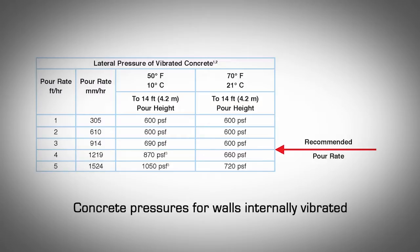Rate of Pouring Concrete. When fresh concrete is poured into AMVIC ICF, it exerts lateral pressures on the sides of the EPS panels. The intensity of this pressure depends on several factors including the rate of concrete pour, unit weight of concrete, type of cement, concrete slump, concrete temperature, height of the pour, and depth of internal vibration. AMVIC ICF blocks have an ultimate forming capacity of 864 pounds per square foot, as tested according to Section 6.4.4 of the Canadian CCMC Technical Guide for Modular Expanded Polystyrene Concrete Forms. This table shows the design lateral pressure for newly placed concrete that should be used for wall formworks, based on the recommendations and formulas given by ACI 347-04. The recommended pour rate for AMVIC ICF is between three to four feet per hour.